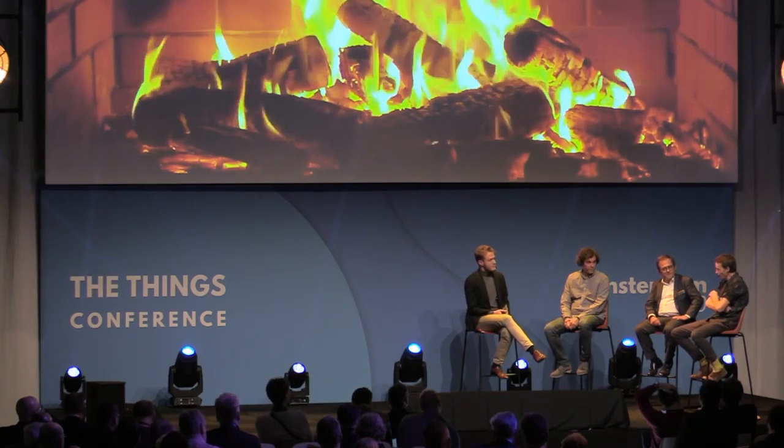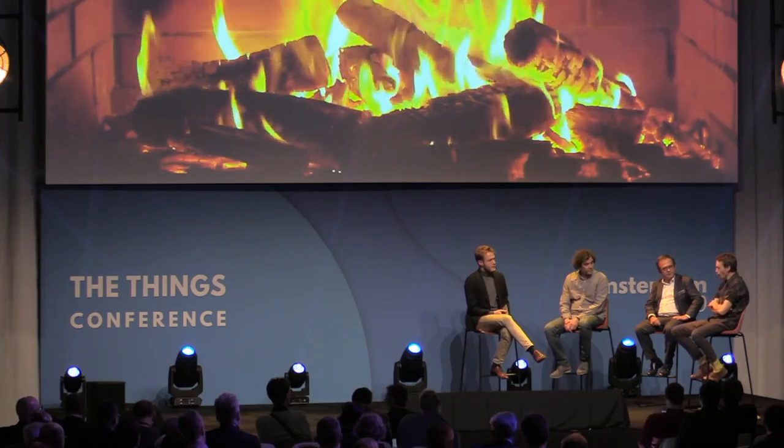Sure. This came really early on. When you want to build the Internet of Things, the approach that 802.15.4 or Zigbee took was to have the same chip on both ends of the link. Obviously, that creates a whole lot of problems. You don't have capacity, it's not robust, you need a single channel network, and you don't have frequency diversity. All of this was obvious.